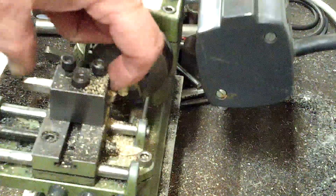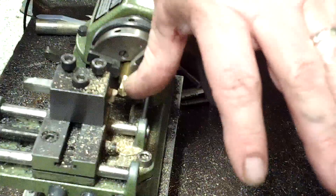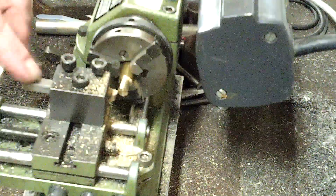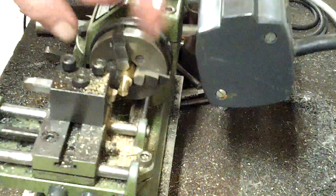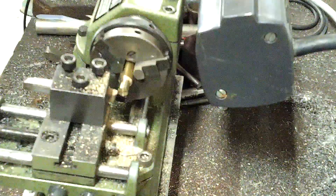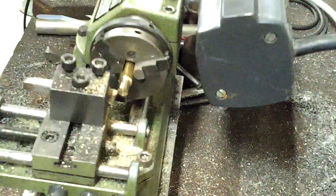The rounded tool is probably a little bit better for roughing. It imparts just a slight wave to it, which isn't imparted by the pointed tool for whatever reason — might be pushing the ground a little bit. Regardless, both of these tools are sufficient for use on brass. We'll have to try bronze and maybe that'll come up in another video, but hopefully this explains the 10-degree brass tool that I make. Thank you.